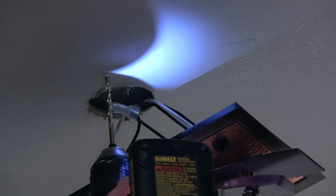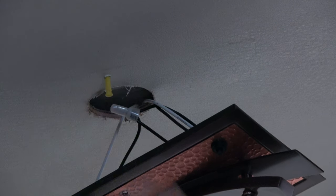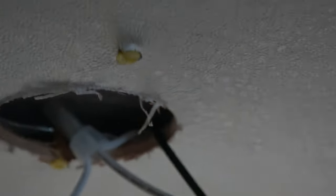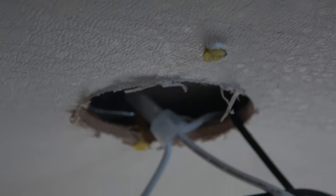It's a little awkward with the light here, but I'm just going to make sure that hole is the appropriate size — which it is. Take the wall anchor and just tap it in. Don't want to hit these things super hard because they will bust. As you can see, I got those wall anchors in there nice and flush. They don't have to be completely flush because the lip on your light will hide some of it.